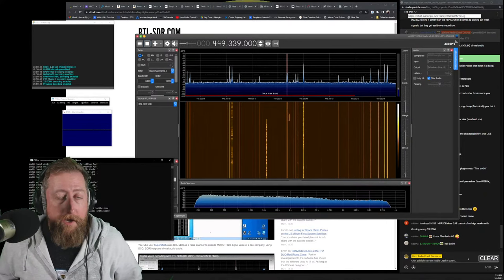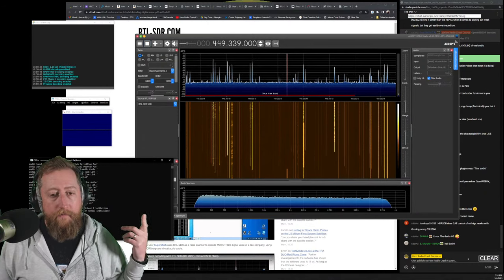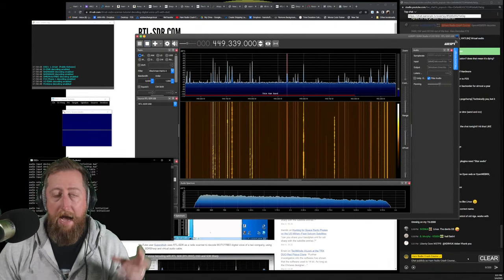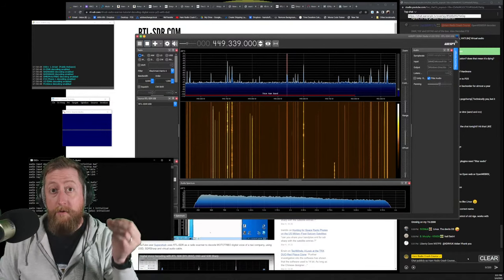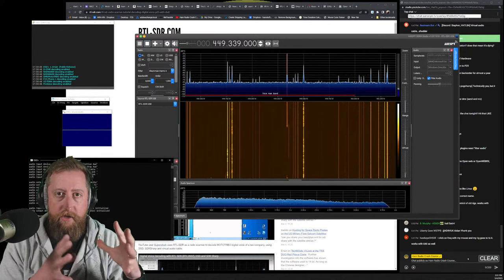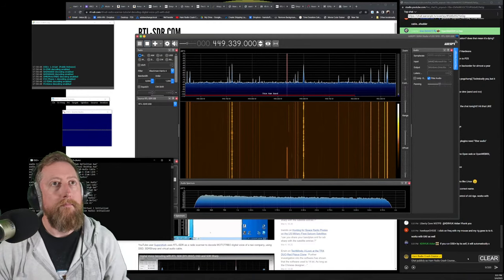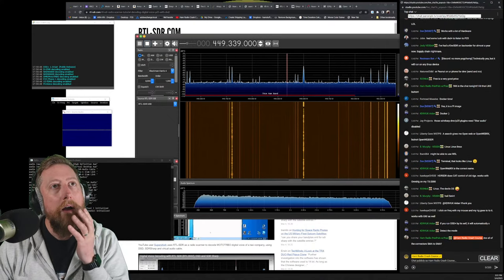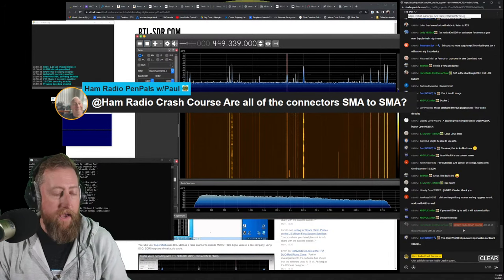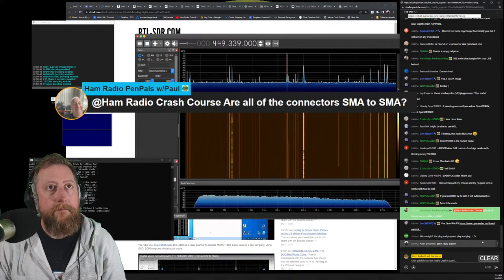Like if you caught my NOAA weather decoding video that you can go back and watch, I used the SDR Uno software with an RSP1A SDRplay device, and I was able to output the audio from what the SDR was picking up to the weather software, and the weather software did the demodulation of it back into the digital image format that we were able to see on the screen. Generally, all of the connectors are SMA if you're doing these kind of SDR-type devices.